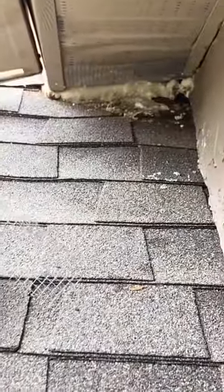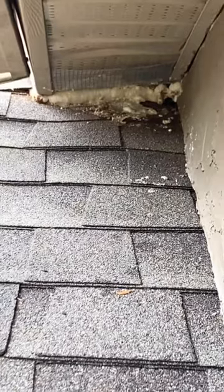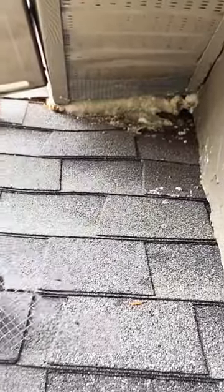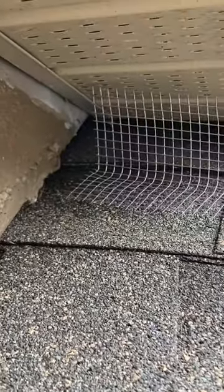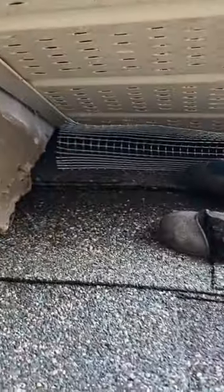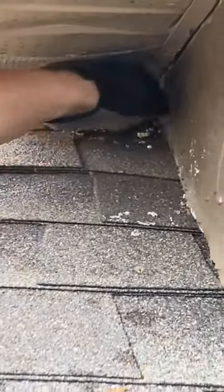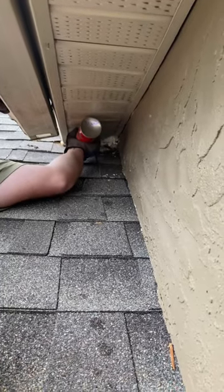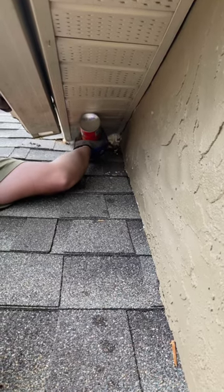That goes up against the first layer of spray foam — we actually sprayed that first set in from the attic once we found out where they were coming in. Then we're going to seal it from the outside also. We're going to put this wire mesh right up in here and just wedge it in. It's just wedged in there with no hardware, and it's pretty secure. Plus we're going to add the spray foam and get that nice and full of anti-squirrel foam.